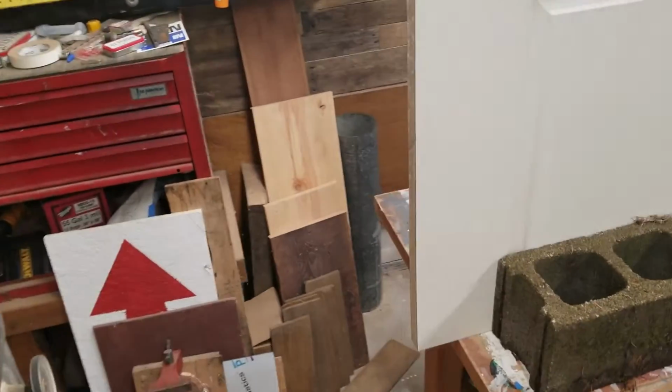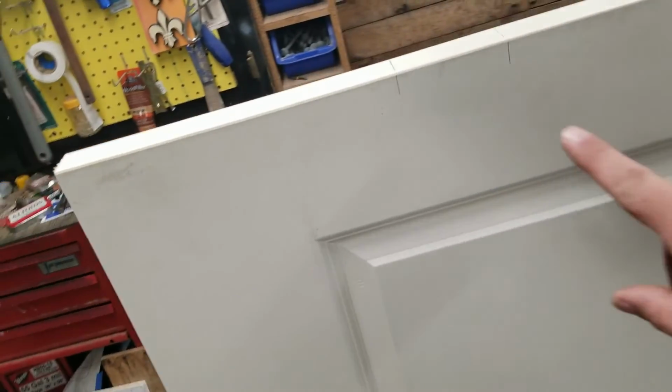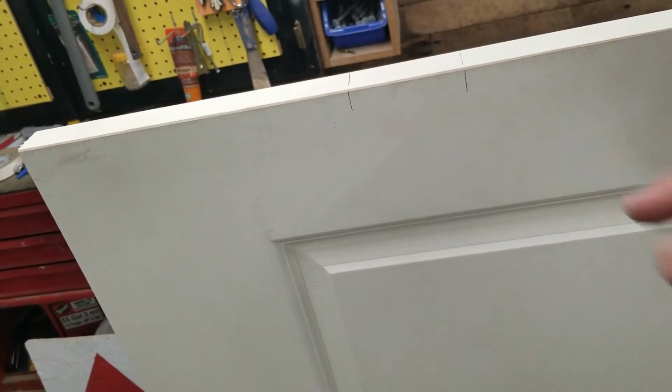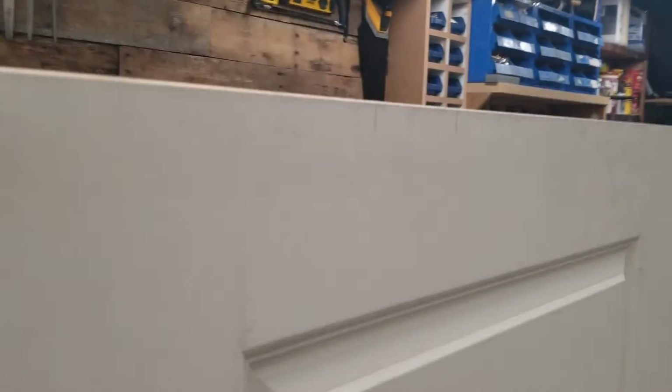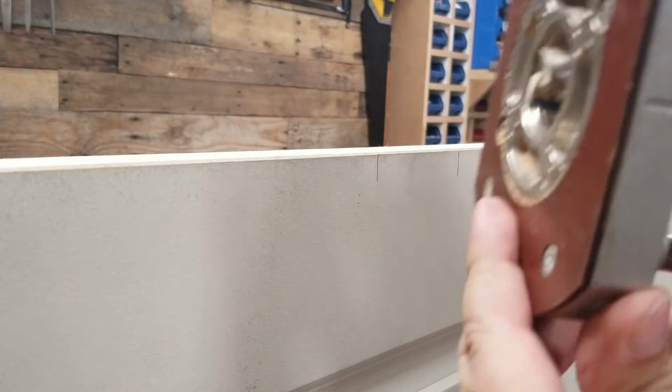How'd you do with a chisel and hammer? I sucked at it. I have a router. I'm going to use that. Let's see how that goes. I've got 2 center blocks, kind of holding it upright. I've taken my marks and I brought them down a little so I can see with my router. See if this works. I've set the depth of my flush bit to the thickness of my hinge.